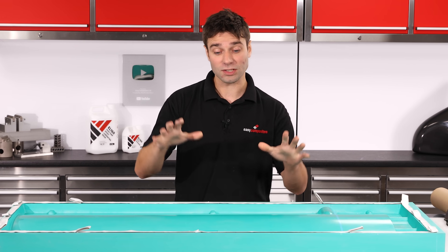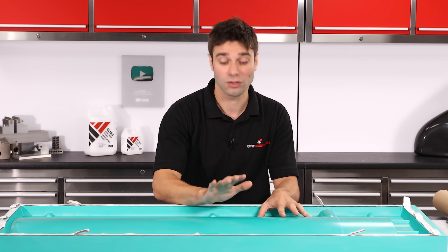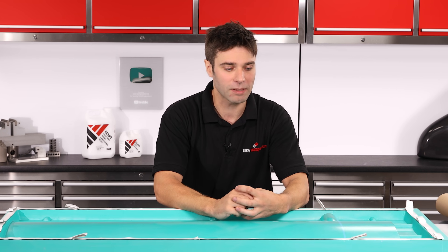So you can see here that this flat plate is slightly out of flat — it's got a slight bow caused by the gel coat pulling against the surface. For dimensionally critical moulds such as this, it is better to run your carbon right the way through to your tool surface, and that's what you will generally see in aerospace and motorsport applications.